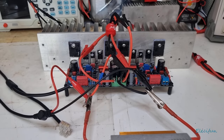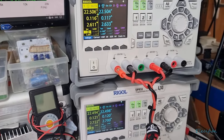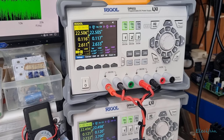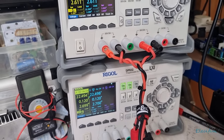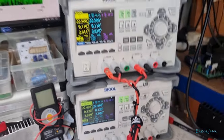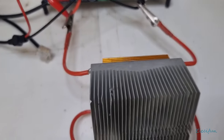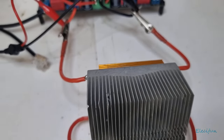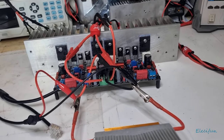I've got this set up now and I'm giving it the full input I can, which is 45 volts a side - 22.5 and 22.5 top and bottom, so 45 volts going in. We're using an 8-ohm dummy load. We can do a 4-ohm check with this but we'll do that using the other bit of kit.